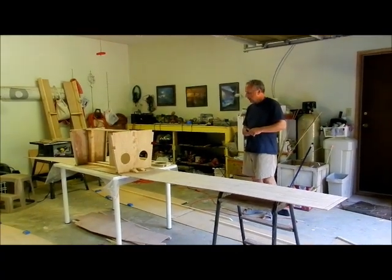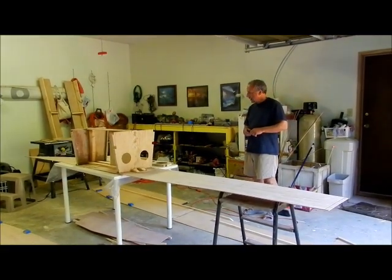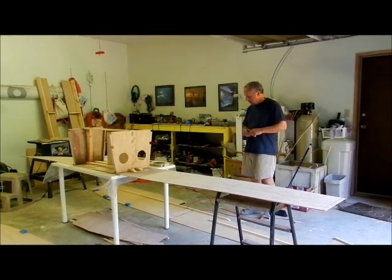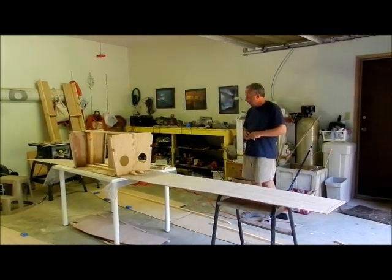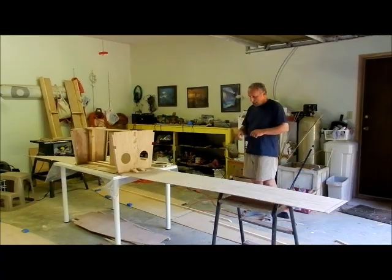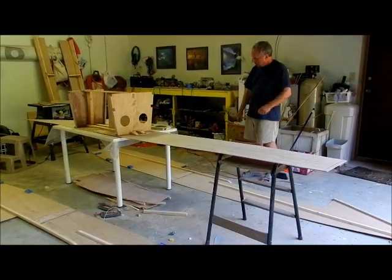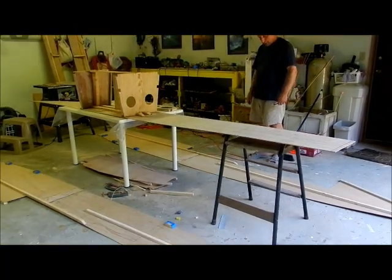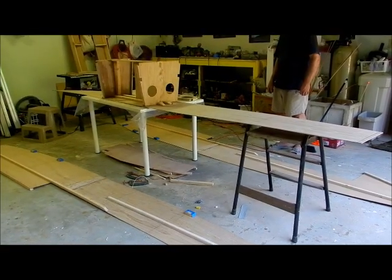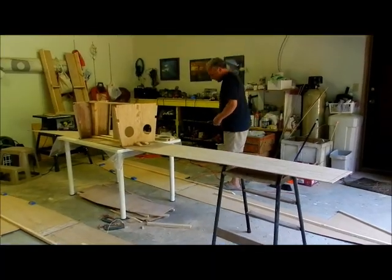And what I'm going to do now is assemble the boat so that it will look like a boat. But I'm going to do it as a dry fit because epoxy and canvas don't really meet. You'll also see down on the panel that I put little blue butt blocks, which are temporary holding for the screws when I assemble it. So I'm going to do this side first.